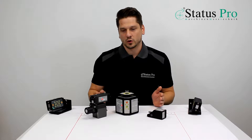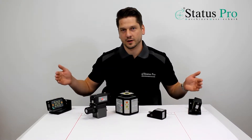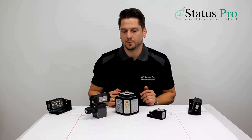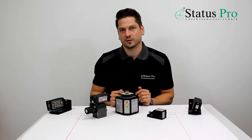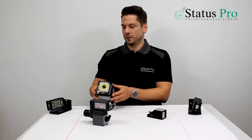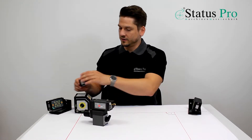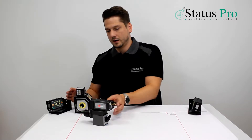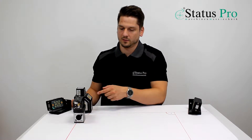If you have two guidelines which are apart from each other — like one meter, two meters — it gets very hard to do it with traditional measurement equipment. So how we are doing it is with our T430 laser. We take our T430 laser and put it in front of our first guideline. We use our distance meter to get the rough position of the R540 and we align our standing laser beam to our first guideline.